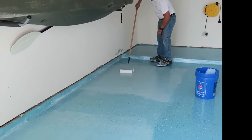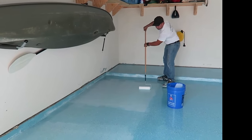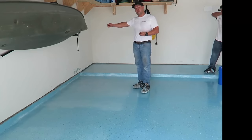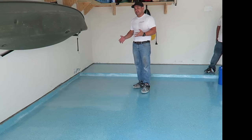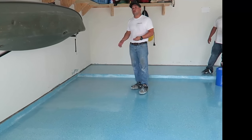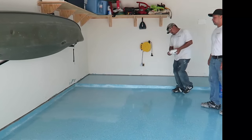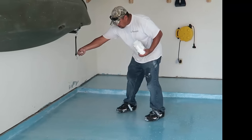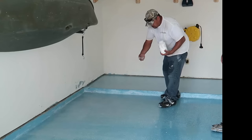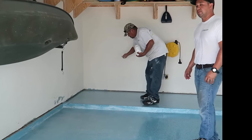Clear coats are tricky — be careful when using water-based or solvent-based products. A good and preferred way to add your anti-slip is to actually sprinkle it lightly onto your clear coat. Anti-slip additives will levitate and leave marks if mixed directly into your paint. Bethel here is going to demonstrate — notice he's sprinkling it slowly into the product. Do not broadcast it like sand. This is plain silica; we prefer Shark Grip.